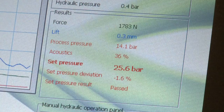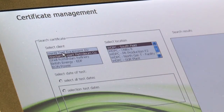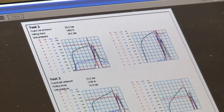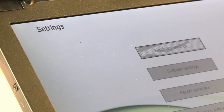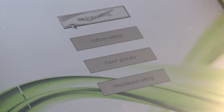The found test results are automatically subjected to and verified with the applicable test standard. Finally, a detailed two-page test certificate can be printed or stored and exported as a PDF file. For easy operation and accurate control, the Prevent test program allows the operator to configure user settings such as the program language, certificate layout, the measuring units and rounding of the test data reading.